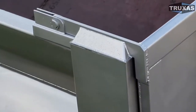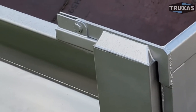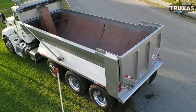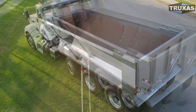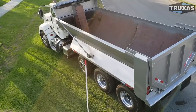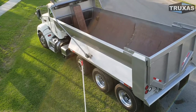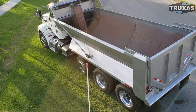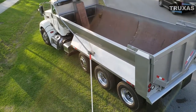It's designed to eliminate grease and avoid having a smaller bushing that can get tweaked out. If you forget and drive around with the high-lift tailgate up off-road, the hinges can get tweaked — but not on these beds from Hall Lane Manufacturing. That thick one-piece hinge system is made out of one solid piece, not two pieces welded together. Several other companies weld together square tubes and that stuff ends up needing repair in a year or two. That hinge is for the life of the bed — about 20 years is definitely possible with Hardox steel, and maybe 15 years with severe use.